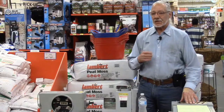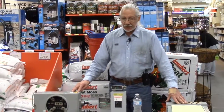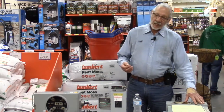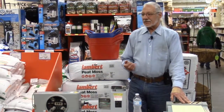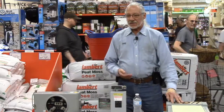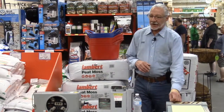Before you pick a box, how many circuits do you want to end up with compared to what you have now? That's additional work over and above what we're talking about here today, but if that's your planning, then you have to pick your equipment to meet that future planning. So if you have, let's say, 6 circuits today and you want to end up with 12, I would possibly go with a 16 or 18 space box at that point, just to get future planning out of the way, because these projects always take on a life of their own. You say you want 12 circuits, and then all of a sudden, oh, I forgot something. I just added an air conditioner to another room, and now you need another circuit for that air conditioner. So you always leave yourself a little leeway.